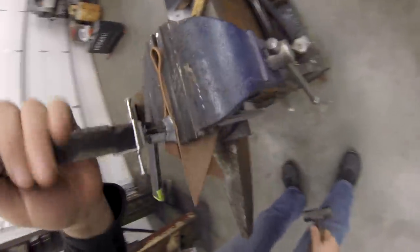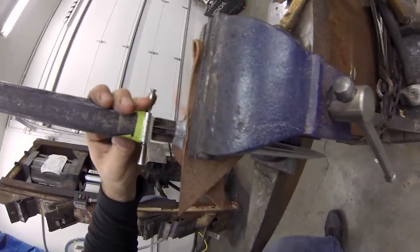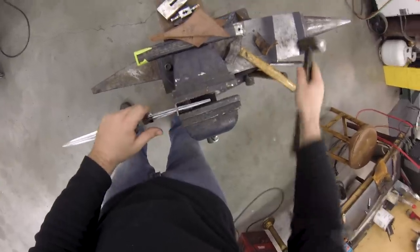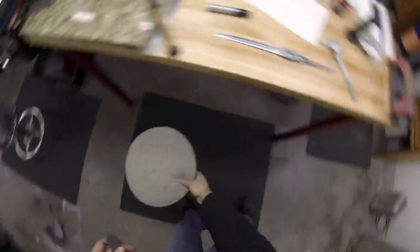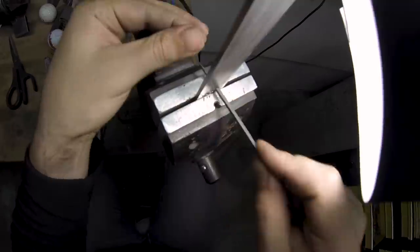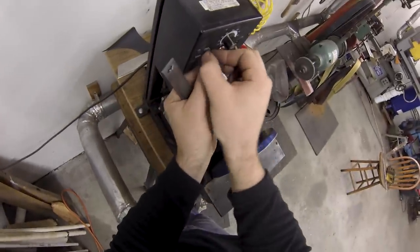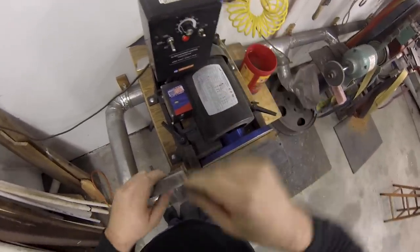This is by far the hardest guard fit I've ever done. The sword I made earlier this year was the hardest, but this one took it up another level — even though it's really small, it was really difficult because of that fuller that goes all the way down the tang. I didn't want a big gap where the fuller disappears under the guard the way you traditionally see on swords and daggers. I wanted the spacer to fit all the way down into the fuller and make it look like the blade just grew out of the handle. I'm going back and forth between the anvil — hammer the spacer on, check how closely it's fitting, file on it, and hammer it on some more. The stuff with the punch squishes the metal around in areas where I need it; if I accidentally filed too much, I can hit it with the punch and kind of scoot that metal back for a second chance.